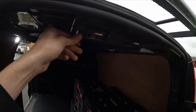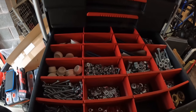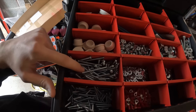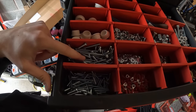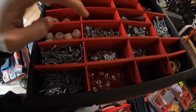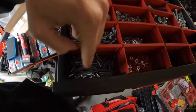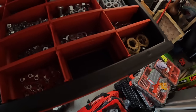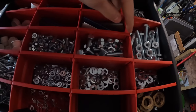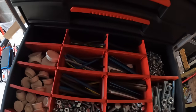Anyone else has a Ford Transit Connect? This thing is lovely to hit your head on. This drawer has literally just taken me about 20-25 minutes to sort out. We've got the fire grommets - the 32s, 25s and 20s - some 50 mil 3.5 pin terminal screws, some 35 mil ones for your standard size, some little crimps for your armoured, going to get some bigger ones for your gas bonding. Piranha nuts there for armoured cables, washers and bolts - all M10s, M8s and M6s. Got all your heat shrink and some wall dogs in the corner.